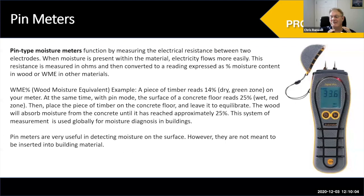Really wet drywall, if you did an oven test, would be about one to one-and-a-half percent actual moisture content. Why do all manufacturers calibrate for wood? Because wood is a very consistent product. There are slight differences from species to species, but it's fairly consistent in terms of electrical conductivity. Whereas something like concrete — its base electrical property changes based on the mixture ratio of cement to aggregate, making a big difference to a conductance-type moisture meter.